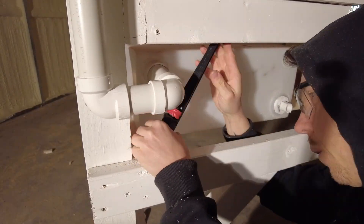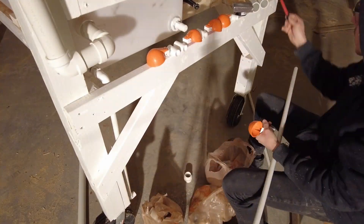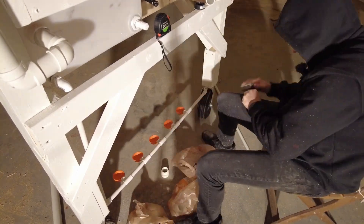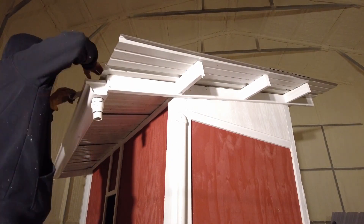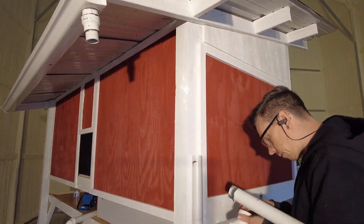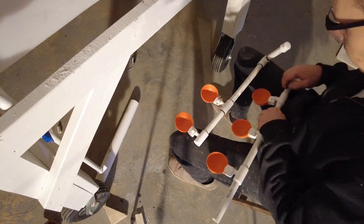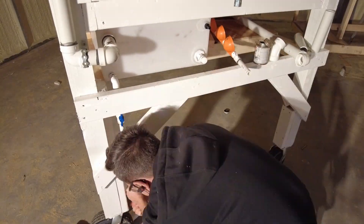Nothing fancy for the water collection: we've got a gutter on the front of our sloped roof which feeds all the water straight into a 30-gallon water tank, and that gravity-feeds through a valve into five self-watering chicken cups — all gravity-operated as well. There's no intervention needed from me to give them water unless we go without rain so long that the tank dries out. During summer months I did have to fill it manually a couple of times, but for the most part it stays pretty full — we only need one good rain every couple of weeks.